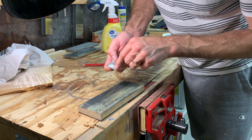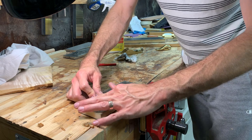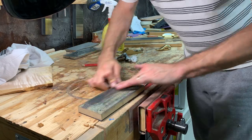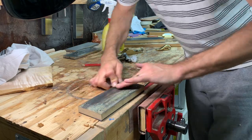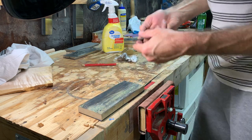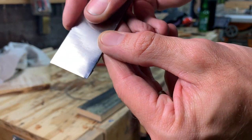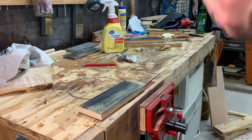That's nicely polished up to about here — probably from uneven pressure on a blade a size that I'm not used to. I'll try to put two fingers down on that from the front instead. And that is a mirror polish right along the cutting edge — that is the only place that matters.